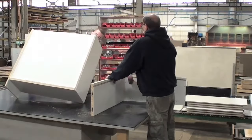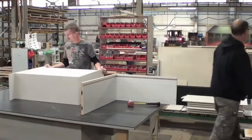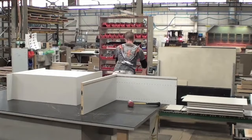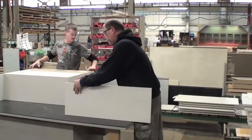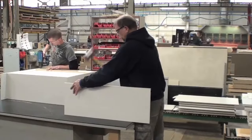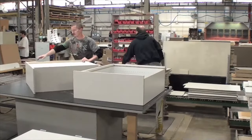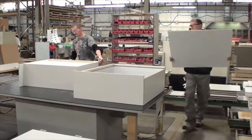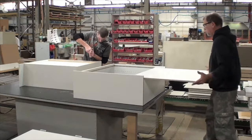The pre-build task is to first retrieve the cabinet top and position it on the work table. Then the employee gets one of the cabinet sides and positions it on the work table. Next, the two pieces are joined together using a rubber mallet. This process repeats for the other sides and bottom pieces of the cabinet. Then the cabinet back is retrieved, slid into position, and secured with the rubber mallet.